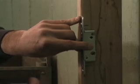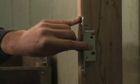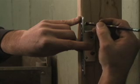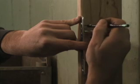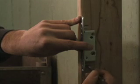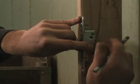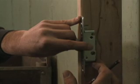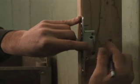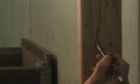Now, taking your mortise lock and holding it up so that the plate is flush with the edge of the door, you want to go below the hole that's going to anchor the mortise lock in the door, but above the closest obstruction, and put a mark. Do the same thing on the bottom, and then in the back, measure just slightly beyond what it would take for this to bottom out. Drilling just slightly too deep is much better than not drilling deep enough, and then put a mark back there.